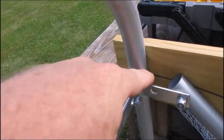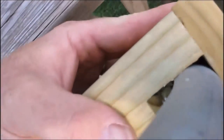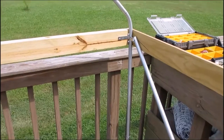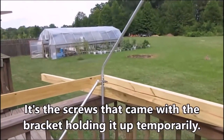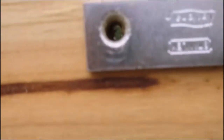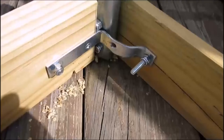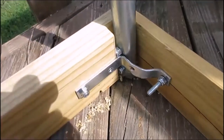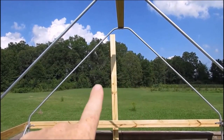It's still a bit too wide here but looks good up top - I've got clearance for the bolts, maybe a shade too long but still doable. Here it's mounted - you can see the reason I went on top of this instead of behind it is because this piece is in the way. The backboard is in place for the middle with one screw holding it on each side. I drill straight through and bolt it, then do the same thing on the other side. The bottom brackets required something different. Before I can put up the center piece I've got to install a window, and the window has to be integrated into the center piece for support.